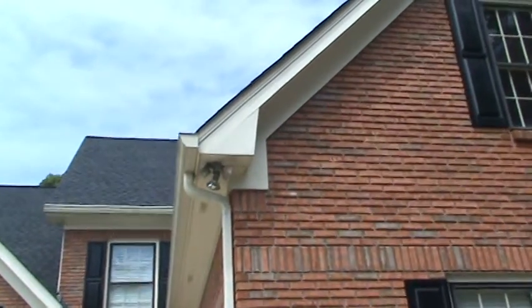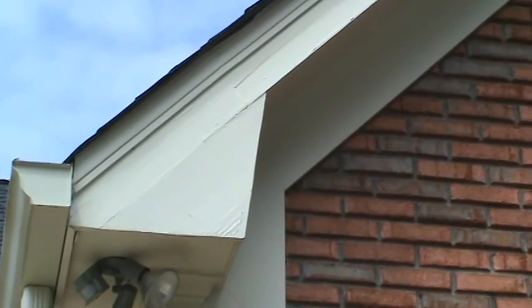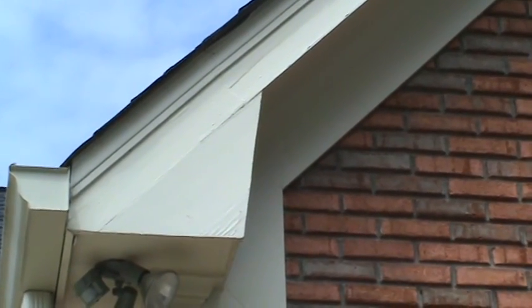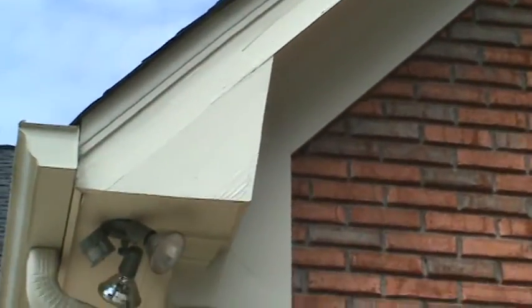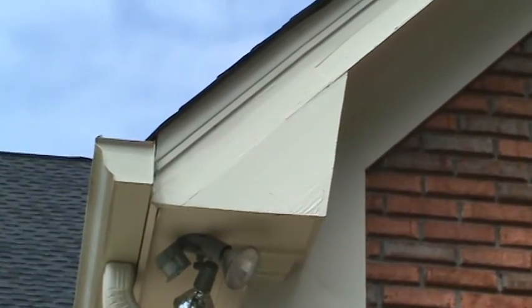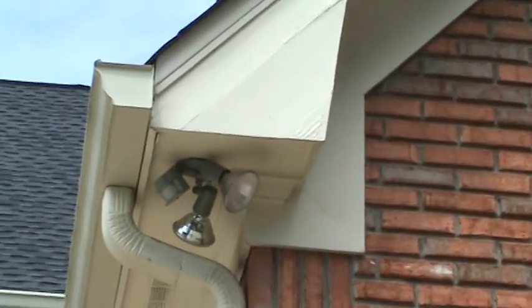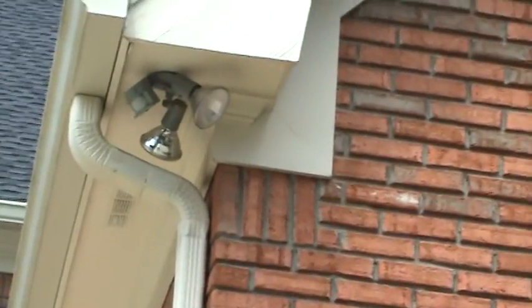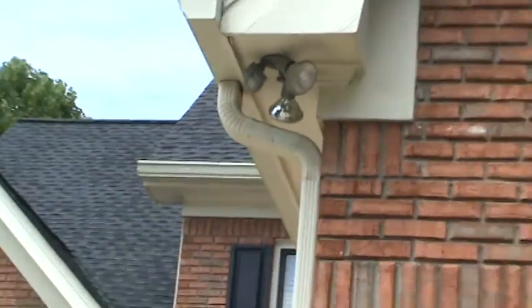If you look right here in this corner — we're trying to get in before it rains — that triangle right there is what we call a dog ear. You'll see that black shade between the fascia board, and up the upper edge of that triangle you'll see where the caulk has failed. It failed a long time ago. The lower triangle shows another line about two inches off the bottom corner. Rather than using a cut-down 1x12, they put two pieces of 1x6 and 1x8 together, glued and nailed them. Now you've got three joints instead of one, and it's rotted out, rotting the fascia board and the dog ear. We'll end up replacing that dog ear.